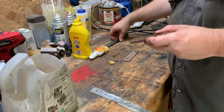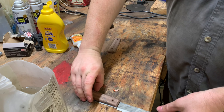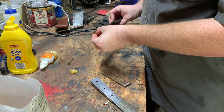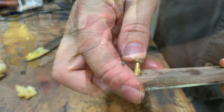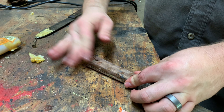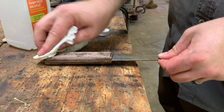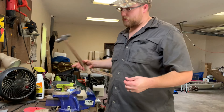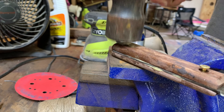Get your scales, put a little bit of water on them, then apply the Gorilla Glue — put plenty on there. Wear gloves; I'm not, but you should wear gloves and safety equipment for everything you do. Wipe off all the excess glue. For the rivets, use a big hammer and do this on a nice hard surface, then put your rivets on.